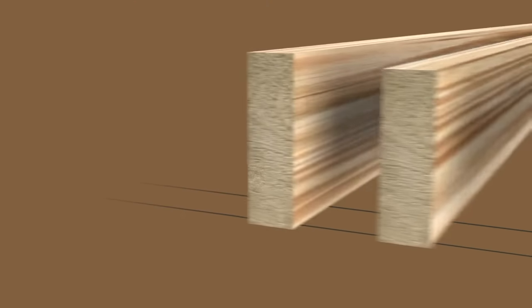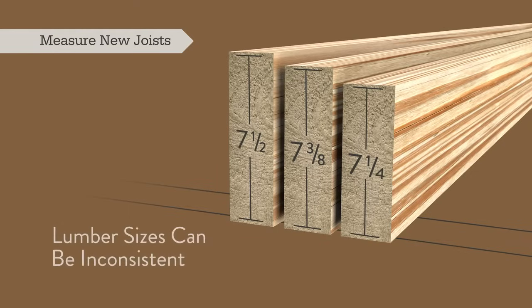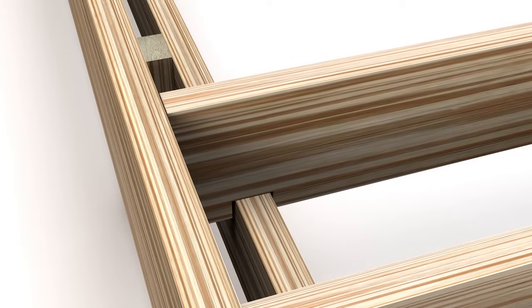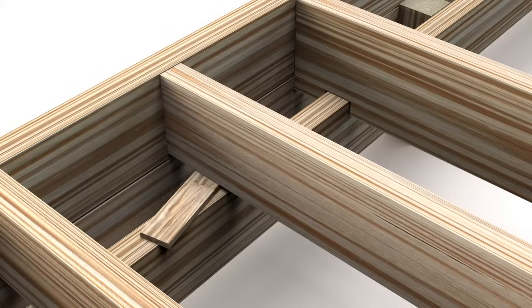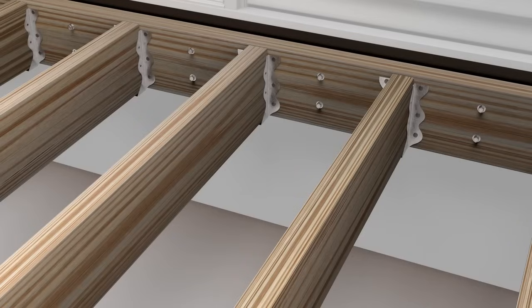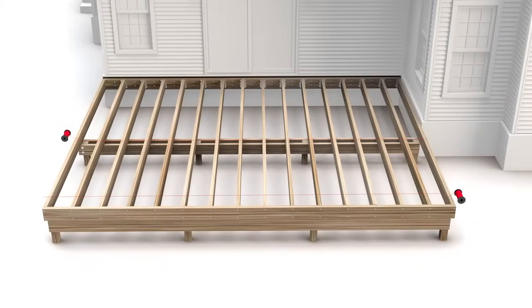If you are installing new joists, make sure to measure and ensure they are the same size. Lumber sizes can vary and be inconsistent. If your new joists are dimensionally inconsistent, a notch or shim may be needed to make sure the tops of joists are in plane, especially in applications where the joists rest on a support beam. Be aware of dimensional variation in the structural lumber when placing your joist hangers. Best practice is to set all the joists in alignment along the tops, then install the joist hangers. Remember to use string lines often to ensure that any new joists are in plane across the tops.